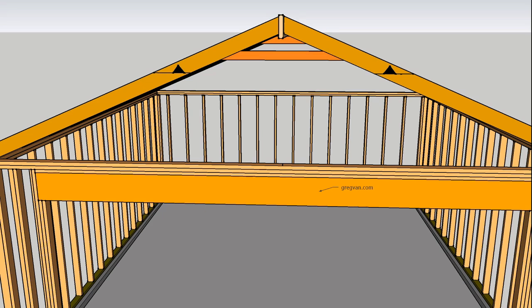This could actually be a problem if you have a lower slope — if you have a really small roof you could end up with a problem. However, if it was such a small pitch, and you had enough room to put a 2x6 ceiling joist in, that would actually act as your collar tie because it would be in the upper one-third area. So if you had 48 inches, you just divide by 3: 3 divided into 48 is 16 inches. You keep the collar tie in the upper 16 inches, or the upper one-third area — that is usually the most common way to install these.